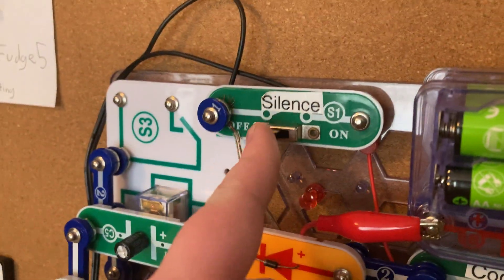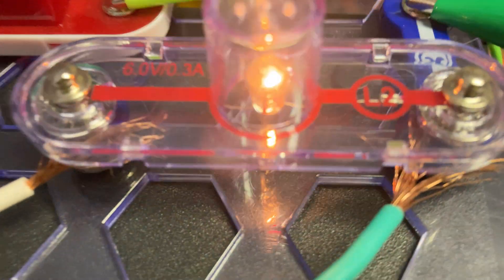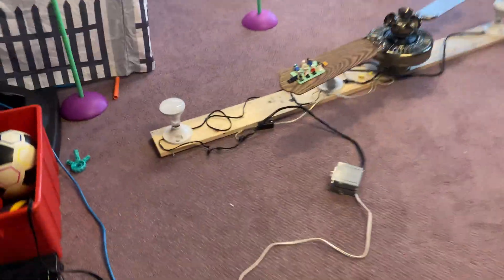We'll come reset this pull and reset the panel. Flip that back and we'll do super slow for the end. I'll show you the relay clicking here. This would most likely be used in a two-stage system — when one pull station is pulled, it would go into super slow like this, which I believe would be general alert. Then we pull another one and it would go into general alarm. So I could sort of demonstrate that.